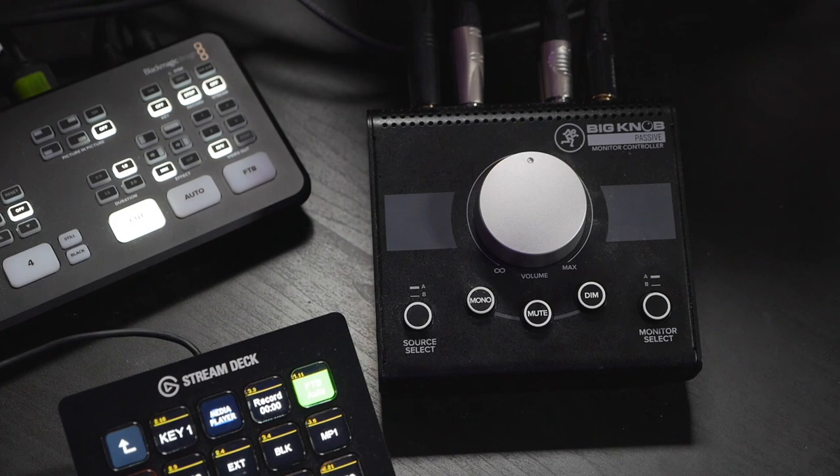Press the source button on the Big Knob to select the subs. Everything you'll hear — whether in your speakers or headphones — will be the sub outputs from the Model 12. Since every channel is routed to the subs, you'll hear everything: yourself, whatever's going through the board, and the people talking on Zoom or on the live stream. But because it's the mains that get sent over USB, and you've unselected the PC return on channels 1 and 2 from the mains, they won't hear their voices coming back to them. That's Mix Minus.